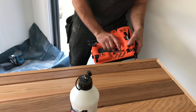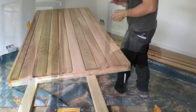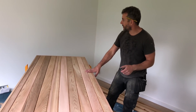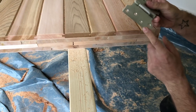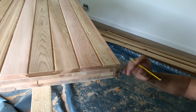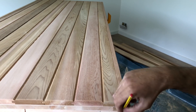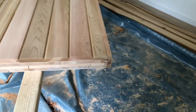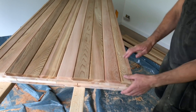I'm going to nip off and get the steel - when I come back I'm going to sand the door, but there you go - there's your cedar clad door. I've sanded it, it's all glued and pinned. We've used polyurethane glue with stainless steel pins - they're all concealed. It's a beautiful cedar clad door - we've lipped and edged it as well. It was a solid core door with cedar bonded to it. Now I'm going to put these parliament hinges on - not for the use they're actually for, just because of the depth - it's the only ones I can get. A normal hinge will finish here and your screw will end up going through and splitting the cedar, so we use parliament hinges. We're putting four of them on because it's quite heavy. It's a big, nice, solid, quality door - that's what we do.